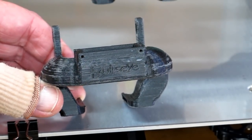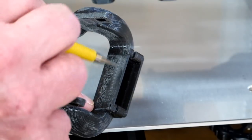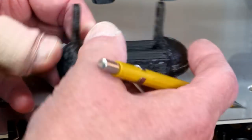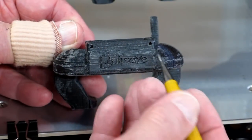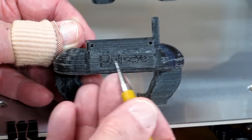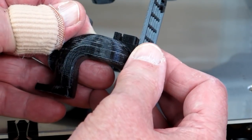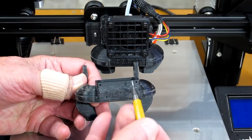This is the Bullseye pipe for the original filament cooling fan — it slips right down in here. Two small 2mm screws that originally held the filament fan to the first base can be run through the ears in the slots to retain the fan. I want to put a fan guard on there since I have a bad habit of sticking things into a running fan. The Bullseye pipe has a plastic frame around it with recessed wording. I printed it at 100% infill and ground away the text, then drilled these two holes all the way through with a number 50 drill and tapped them with a 2-56 tap.